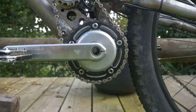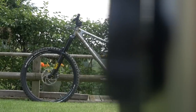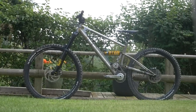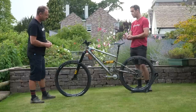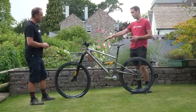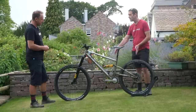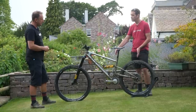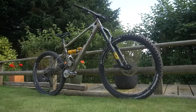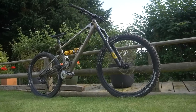The Free Flow motor in there is super compact — it's a really nice silhouette from this frame. What about the geometry? You're looking along the same lines as your previous 170 bikes — the 170 bike we did with a conventional drivetrain, it's the same. I think it's 64 head angle, 77 seat angle. It's got quite long stays — I think this has got 450 stays. Reach, I think this one might be 475.